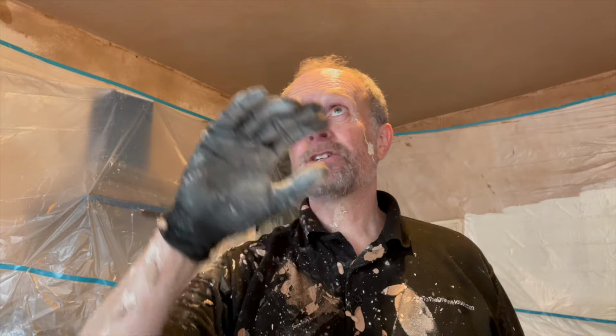The problem was, it had that paint, that thick paint that leaves kind of ridges and spots, little peaks. So I had to go on fairly thick, but we thought we'd try this SBR instead of PVA. Now this paint just did not absorb the SBR and it is rubbish. It stayed there as a liquid. And as I tried to put the plaster on, it just smeared it.